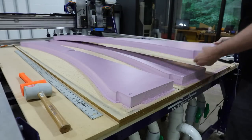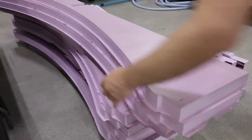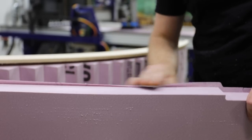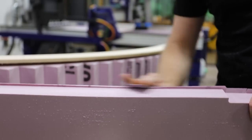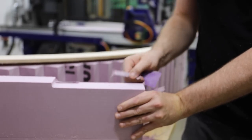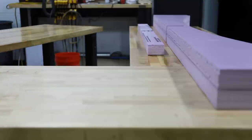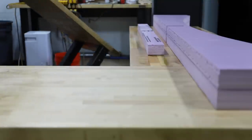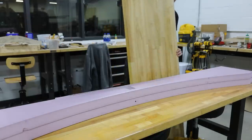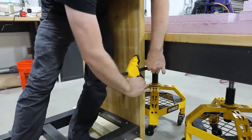Pink foam is perfect for this kind of mold, for its consistency and ability to be sanded smooth. By slightly onion skinning the profile, I save the spoil board, since this edge is easy enough to clean up. I needed to make a 90-degree workspace so I could glue up the sections using the center registration.